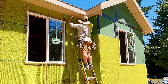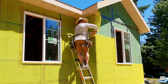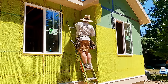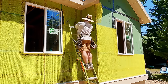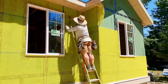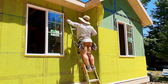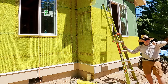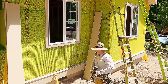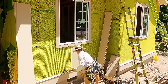We chose to install it right up to the windows — the windows are already correctly flashed, taped to the wall, it's an airtight detail. We go right up to the windows so all of the trim also stands proud, and we don't have to account for that quarter inch when we pack out the LP trim. There's no need to layer this stuff and flash it meticulously. Even a little gap between layers is okay — its only purpose is to stand the siding off the wall, so you don't have to be super detailed.